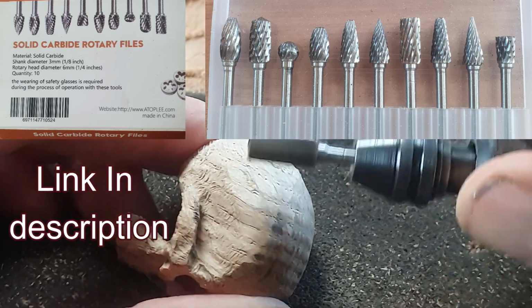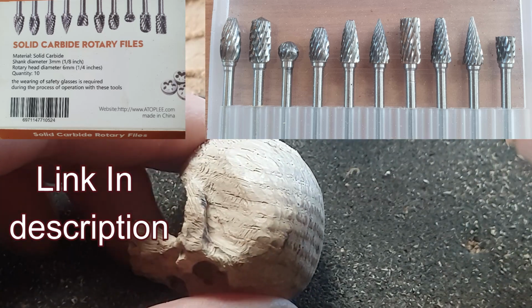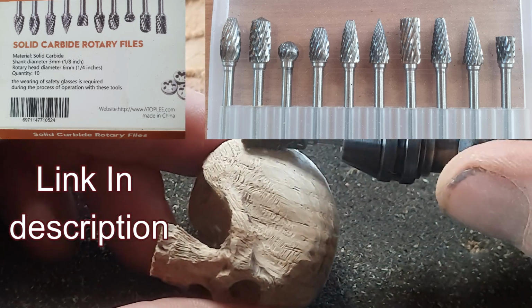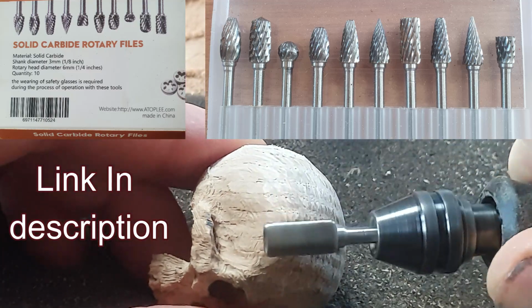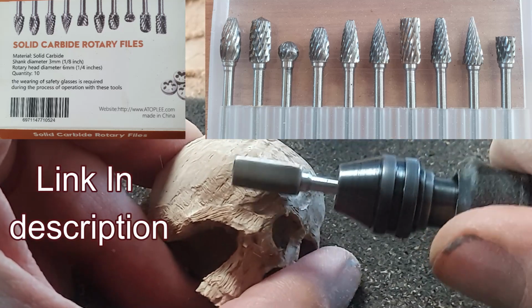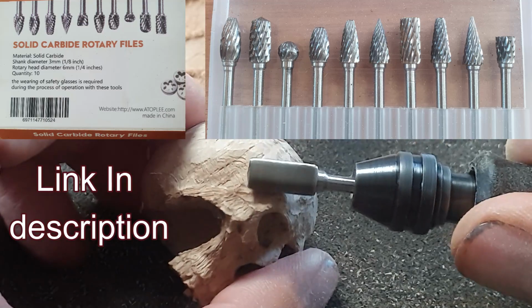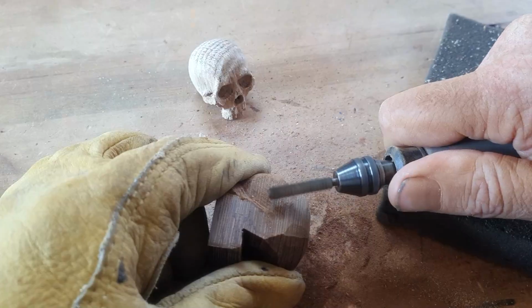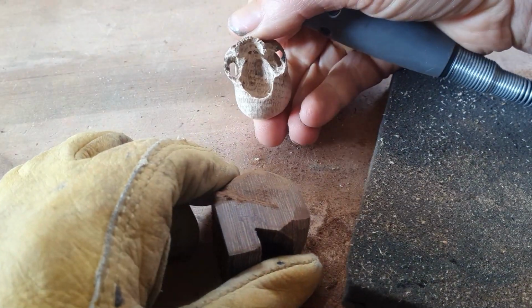Okay, these are a nice little pack of cheapish burrs. I've got a link in the description to them, but what I use them for is taking out the marks left by the extreme burrs on large areas like this, and I use it like a planer. I go really lightly, so I'm not using it to shape, I'm just using it to take out those scratch marks. But if you wanted to, you can use them for shaping as well.